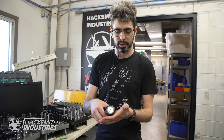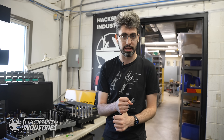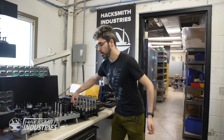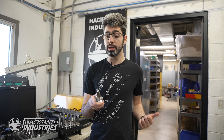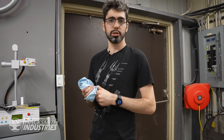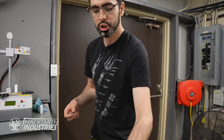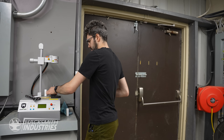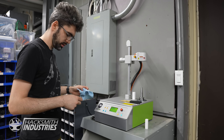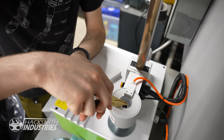With two new machines we need to hold all the tools required to make the knives. In the past I've used ER collet chucks — this is fine for prototyping since one holder can hold any number of tools, but it doesn't hold the tool perfectly on center or as stiffly as it could. So we're going to shrink fit for this new system. All these holders have one size hole and can only hold one specific tool. An ER collet chuck has a clamping range of about one millimeter. With shrink fit it holds one specific tool size — this eighth-inch tool doesn't even fit in right now, but we put it in this piece of equipment, give everything a wipe down, hit the heat button, and six seconds later the tool drops right into the hole and it's shrunk in there.